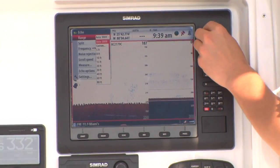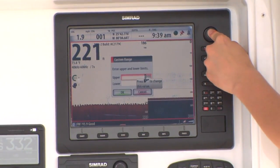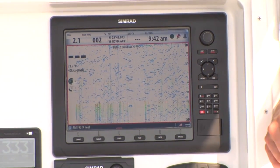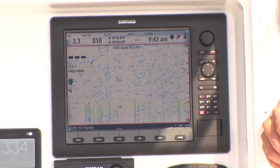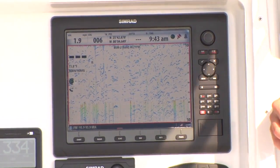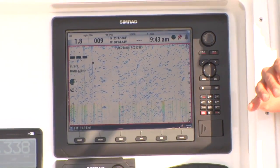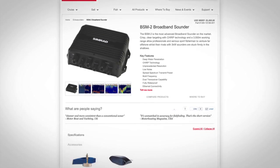Using custom upper and lower limits is an exclusive feature only found on the Simrad NS series. Setting a custom upper and lower limit is ideal for trolling tactics when you want to selectively choose and monitor an area or range within the water column. Custom upper and lower limits allow the fish finder to only look at the area on your screen — so instead of sending a pulse all the way to the bottom, which could be a thousand feet, you're only looking at the top 50 feet. This means the scroll speed can be set to the shallower depth, giving you a faster scroll and avoiding pixel stretching as if you were looking at the full thousand feet. As you can see, the BSM2 broadband sounder with Chirp provides a unique advantage on the water. For more information on Simrad products, visit SimradYachting.com.